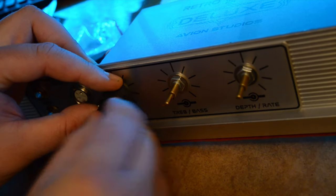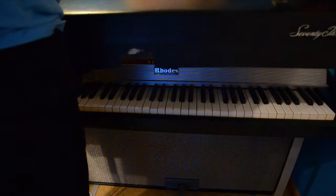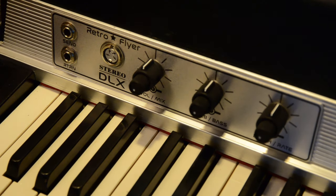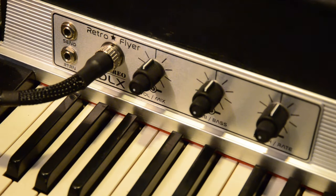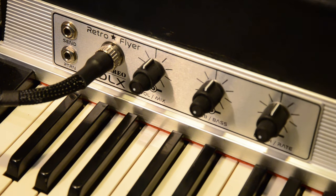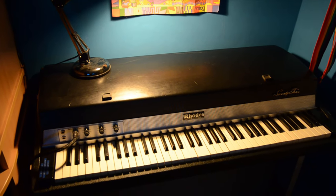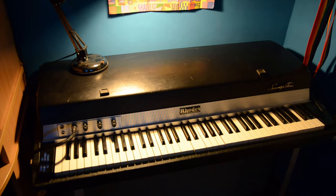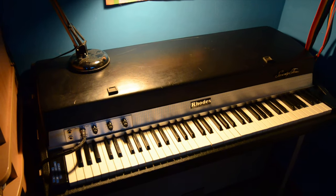Let's get this built back up — name rail back on, RCA jack back in, screws back in, and harp cover on. Overall this has been a very easy install. I'd imagine that other preamps probably install just as easily. It is a good bonus that the kit includes the rarer tools, though you will need a screwdriver and a socket for the pots. But yeah, it does look fantastic. Obviously you want to know how this sounds, so subscribe and that'll come up soon.